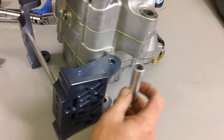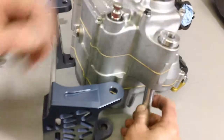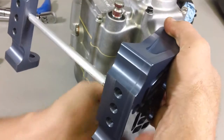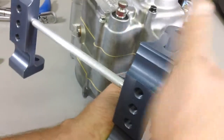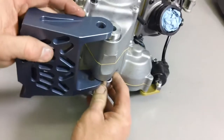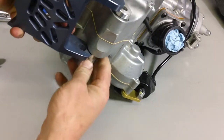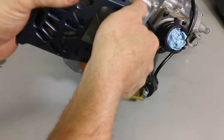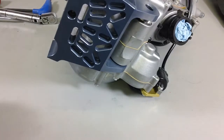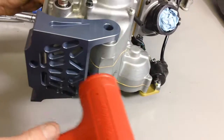The spacers are designed to drop inside the rear case, then you slide in the tube on the inside — this is where the mallet comes in handy. You don't want to beat the mount on; it should be a nice, snug, almost press fit. If you can't manhandle it on, inspect the mount and cases for any damage. Some older cases may have different spacing, so always be aware of that. It's just light taps — don't beat anything on.